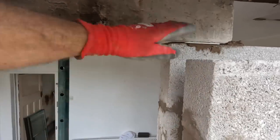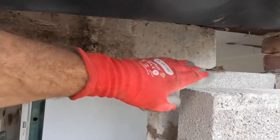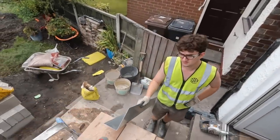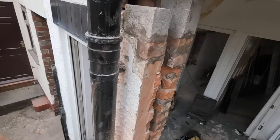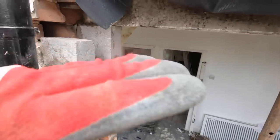Like I say, we've had to raise this up to get the height for the tray to come over the top. She's got the lintel, she's got about probably about 180 up stand on that. Nice big up stand. It was quite wide, yeah. So we're all ready to get this in now, get this on, get the tray over, get it all bricked up.